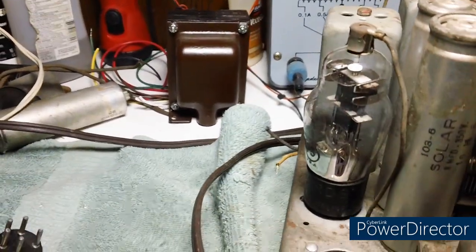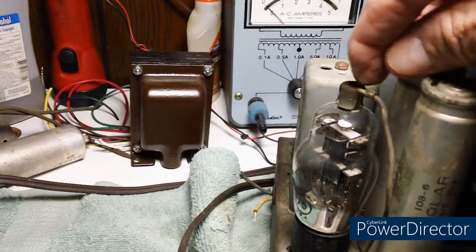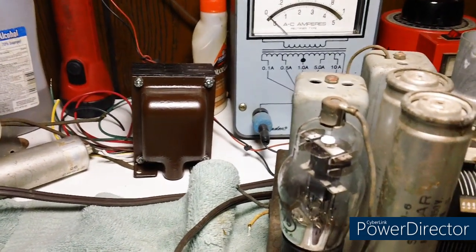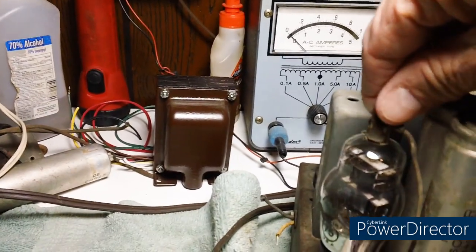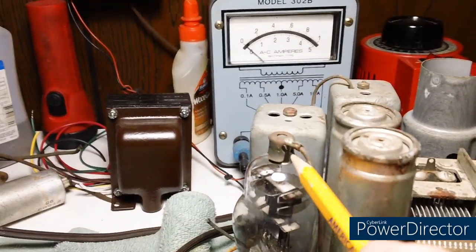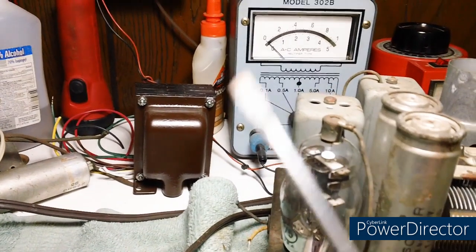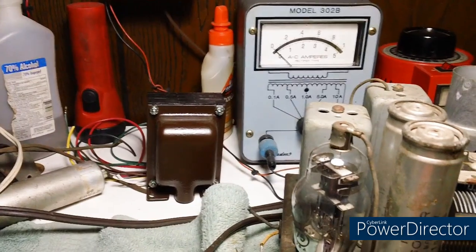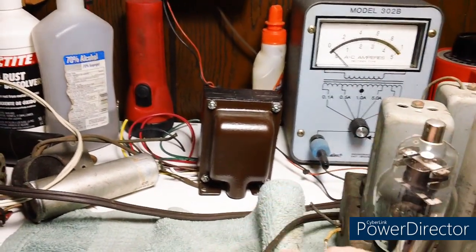The next one we're going to pull out has a grid cap. Some of them are grid caps, some are something else — I haven't really studied the schematic that much yet. These caps will sometimes pull right loose from the tube. I've had them come completely off and break the wire. You've got to go gently — just kind of gently twist back and forth. But watch out: sometimes when you're twisting, you're also twisting the grid cap itself. Just take a little screwdriver, give it a little twist, and see — yeah, it's starting to come up. Okay, good. Pull it straight up.